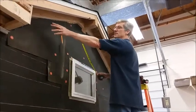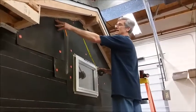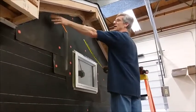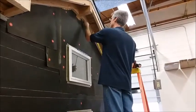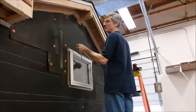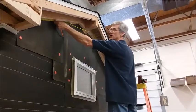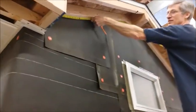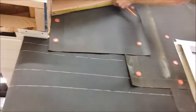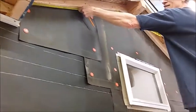We're going to cut a piece of J channel, 1/2 inch J for the soffit. It needs to fit right along this edge here on the rake, and go horizontal here and back down to the other box soffit. So I'm going to measure the distances. I measure down to there, right up to where that bend is going to be. That's about 41 inches.